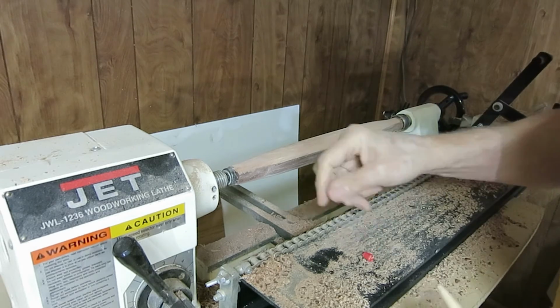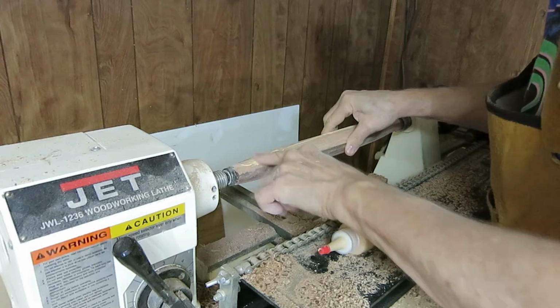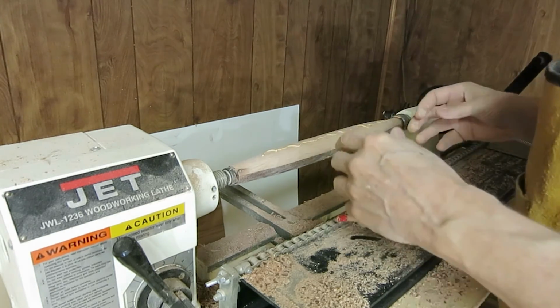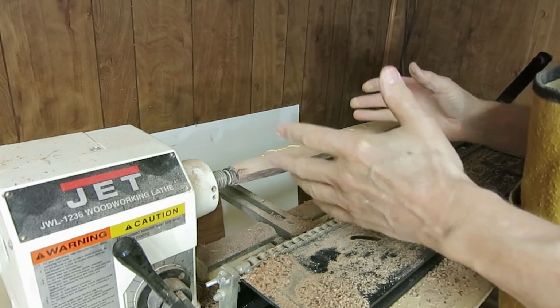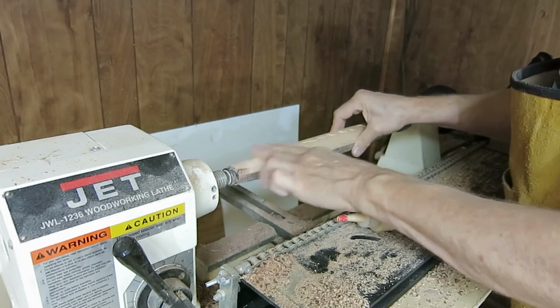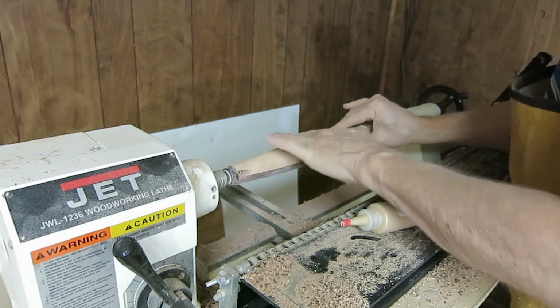It's a real simple process. Pretty much done by hand. Put it on there like that and just rub it across the grain. You know, it'd be a lot easier to go down and buy some 8/4 maple 2x4, cut it in half, have a 1 3/4 by 1 3/4 square piece, or 2 inch by 2 inch, and not have to worry about filling the grain and gluing it together and all that other stuff.